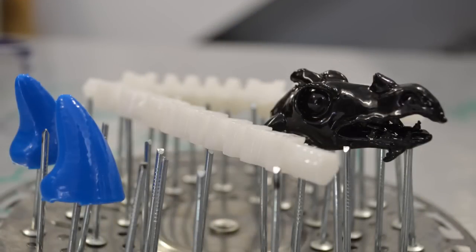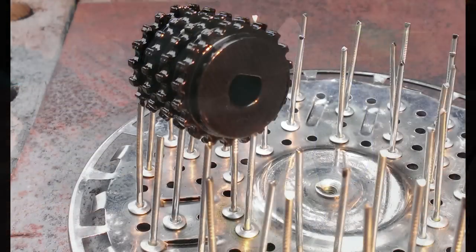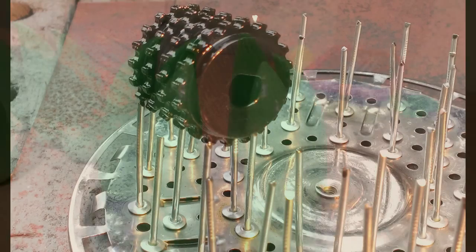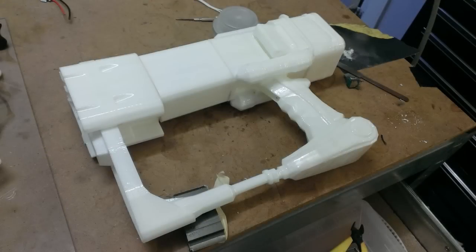Just a few things to point out: this only works with ABS — it will not work with PLA. And it only works with good ABS filament. If you buy cheap ABS filament from China or unknown sources, often it's not actually pure ABS, so it won't smooth very well — it might have HIPS or some other random plastic mixed in. I can recommend the genuine UP plastic; that stuff works amazingly well, though it is a bit expensive. If you're unsure whether your filament will smooth well, get a bit of it and try to melt it into acetone. If it completely melts, you know it will smooth well. If it doesn't, there's something else in it.